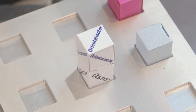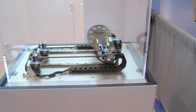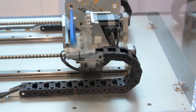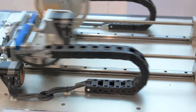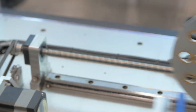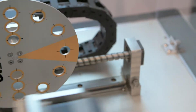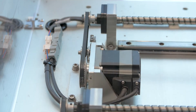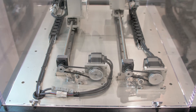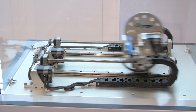The other demo on display — we call it our Alpha Step Poker Demo. We have four axes working in unison with each other, and the hallmark here is our AZ series absolute mechanical encoder servo stepper hybrid motor. When you look at the precision and the quick snappy movement it's able to create during this operation, it's really unique — that open loop performance but also that closed loop reliability. There are no limit switches or sensors being used; everything is truly absolute. Even in a power-off situation, we can continue our motion because our mechanical encoder has an 1800-turn memory of absolute positioning.